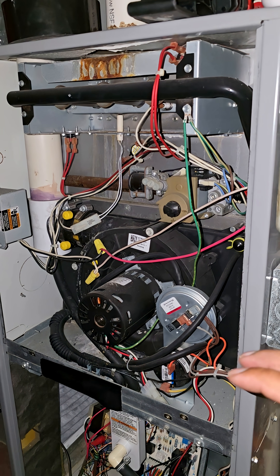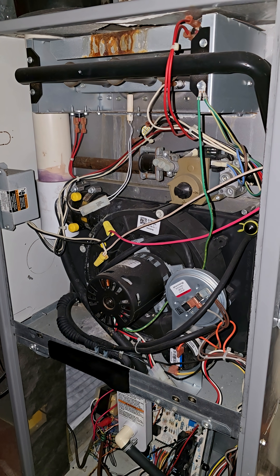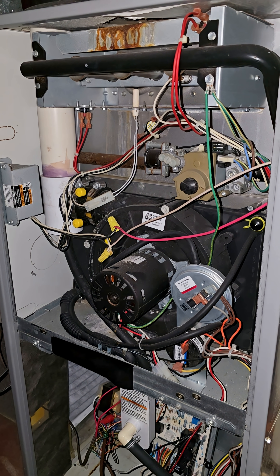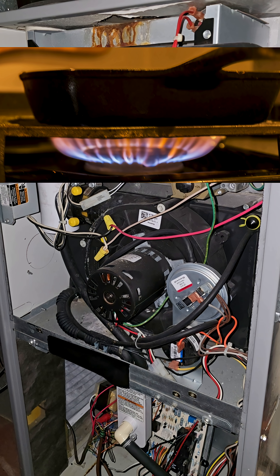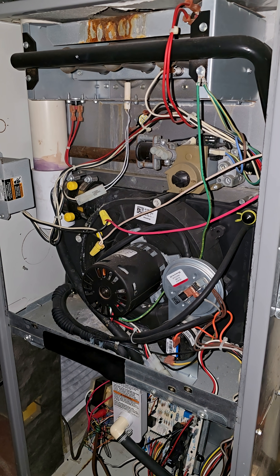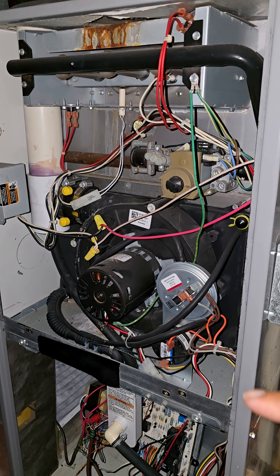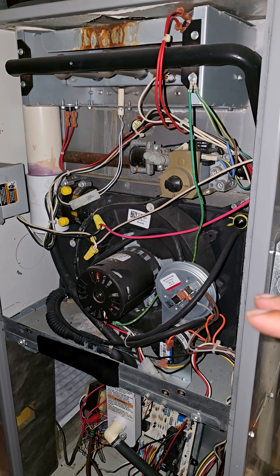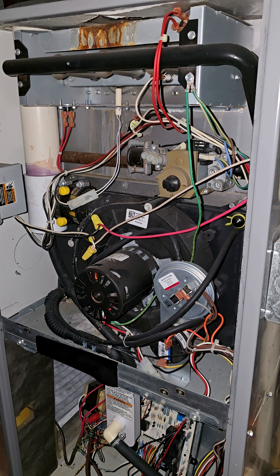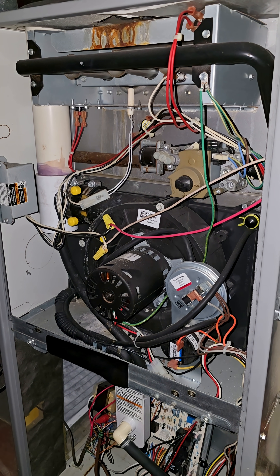It was quickly short cycling and my Nest thermostat was even giving me an error. Once I started noticing this, I was also noticing a burn smell in my home — it smelled like a pot left on the stove for too long, not an electric smell. Many HVAC guys will tell you that's just dust burning off, but this smell continued throughout my house for a few days, and dust would probably burn off in a few hours, not days.